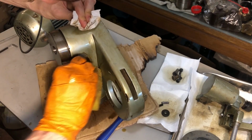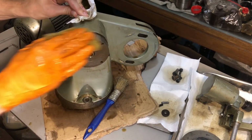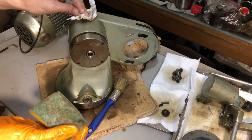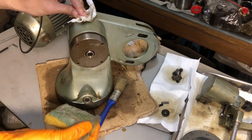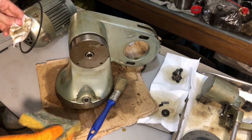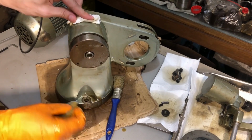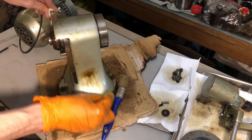You could consider the kitchen rag to be slightly abrasive, but after being used in the kitchen for a month and scrubbing all the other things, it really doesn't pose any real abrasive potential, at least of wearing down the precision surfaces. Of course you can damage them, especially if we are talking about instrument grade precision, but just for dealing with a casting like this, which will have to be taken apart fully and stoned and honed in certain places and retouched in others, there is little harm that can come from it.